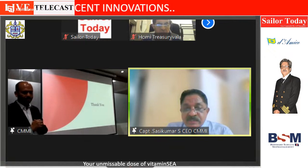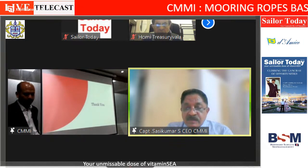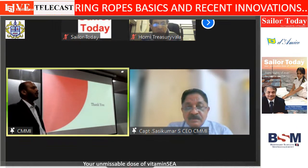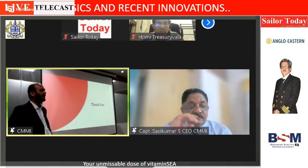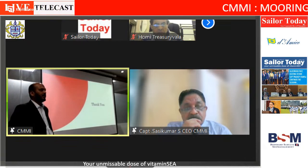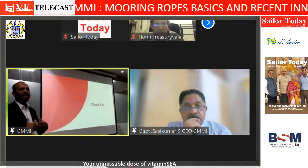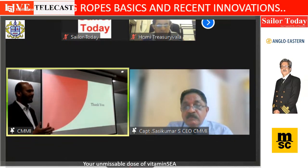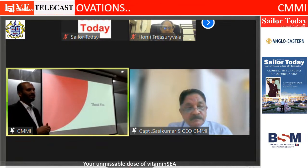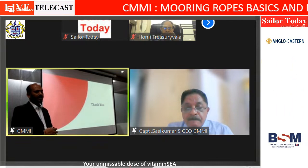Thank you, KISHOR. We have a few more questions to take. Do you have to customize your rope manufacturing as per the ship's SDMBL? Do ship owners have to specially coordinate with you for this? So, ropes have to be defined by the SDMBL of the vessel, and that's a mandatory requirement. It's always better if the ship management company or the ship owning company purchasing the rope advises the rope manufacturer on the ship parameters, SDMBL and other things. It will be helpful for the rope manufacturer to give you the right quality of ropes. So yes, it will really be helpful, and that's actually a mandatory requirement from the MEG4 guidelines.